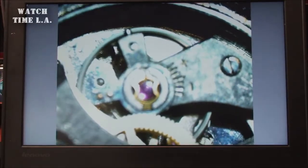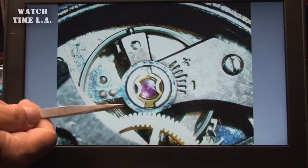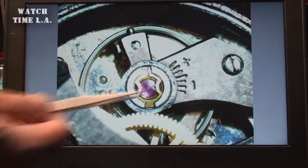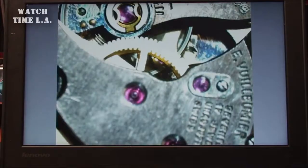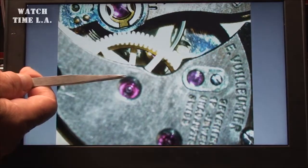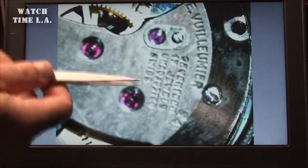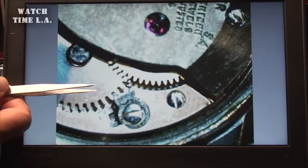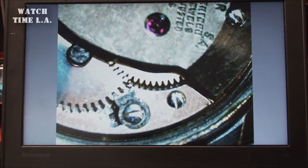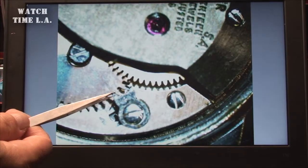I say that's all it is, but there are a ton of parts inside this thing. You can see the spring much better — this is literally the thickness of a human hair. And everything is perfectly balanced and calculated so that the time is correct. Now you see how fast that escapement is spinning around as opposed to the second wheel. We've got a couple of gears here, and this is where they get stepped down. These gears right here are working probably the minute hand — you see how slowly it's going. That's turning that, which is turning that.